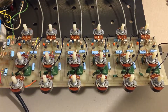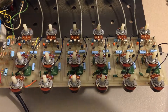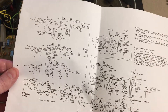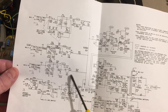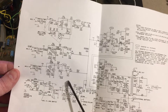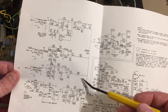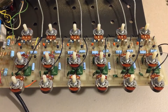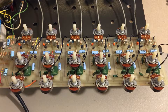The original idea was to get a Shure M67 style mixer, which has lots of mods documented. In those mods, the signal goes through a gain stage into a low-cut filter, and after that resistor you tap off to an output. This is a similar idea, except this way I have EQ knobs instead of just a high-pass filter.